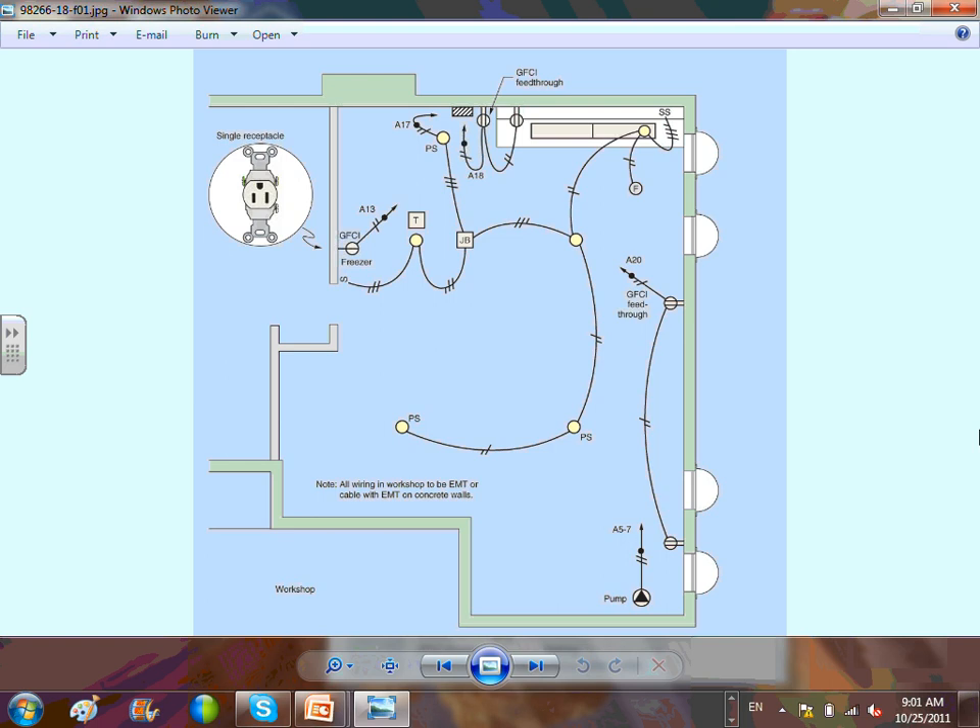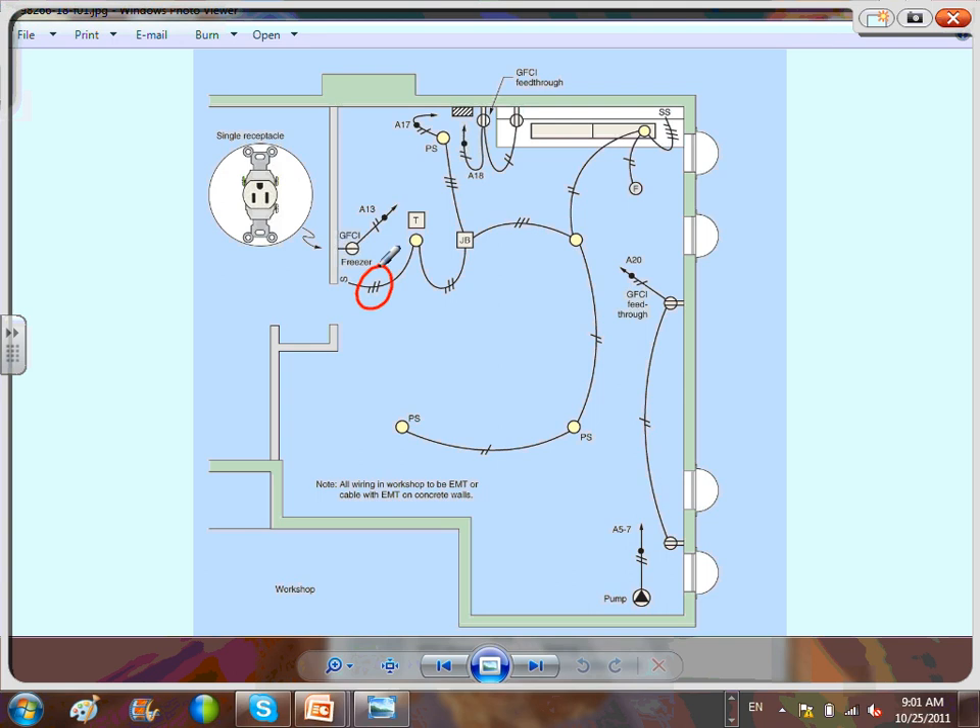Here's another example of wiring things. Why do we have two conductors here? Why three conductors here? It's not a three-way switch. One conductor brings the hot to the switch, one is the switch leg back, and the third is the neutral — because we need a neutral to every switch. All these lights are switched directly, and you can also control them individually by pull chain or all together from a switch.